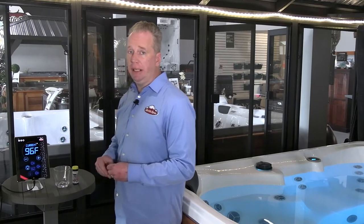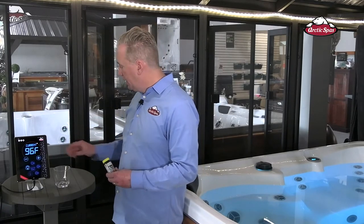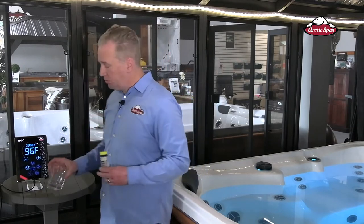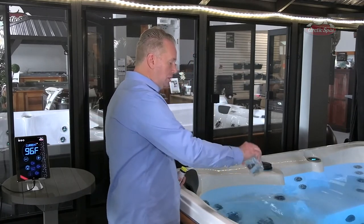As the salt dissolves and we're adjusting our pH, the water will go cloudy for the first little while. It won't be long before it clears — this can take up to the first 24 hours depending on your location and water quality. This is a great time to test our salt level to make sure it's in the proper recommended range. Once it's in range, you don't really have to do this test much unless you do a top-up, a drain and fill, or have reason to test again. To take a sample, use a shot glass so we don't get the top of the test strip wet.